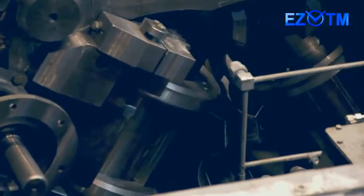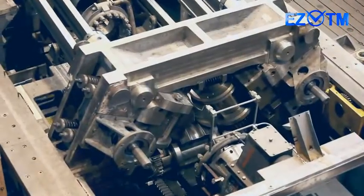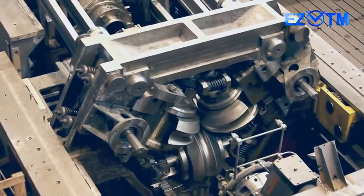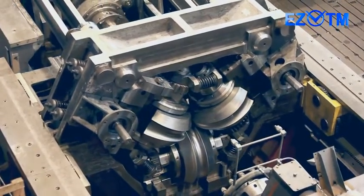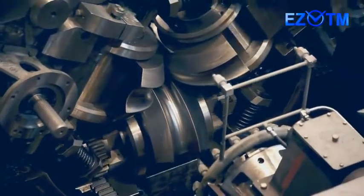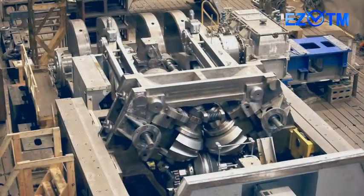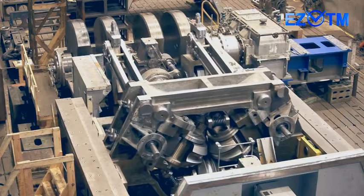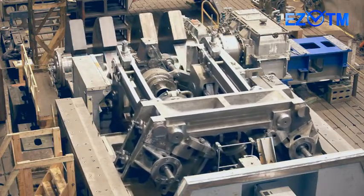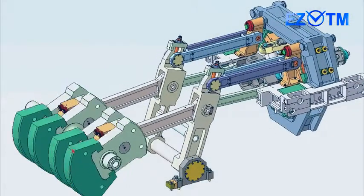Cross-section connector implemented in the cassette case design, locked by means of wedge connections, allows simplifying and reducing time for rolls and tool changing. The lever drive system enables getting periodic forced rolling die diameter along stand stroke. This die diameter is the closest to the designed rolling diameter, which makes it possible to perform rolling with minimal axial forces.